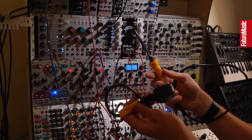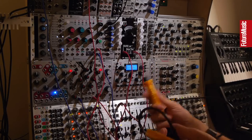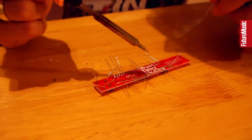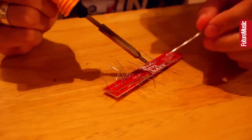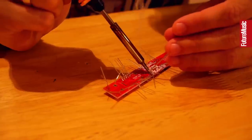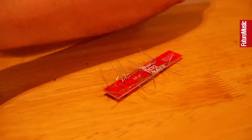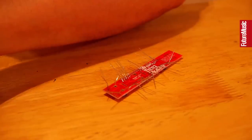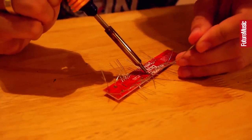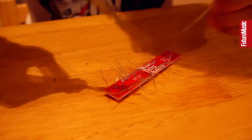It won't cost you an arm and a leg — just a simple electronic soldering iron. You can buy little kits that have the iron, a little cradle to slot it into, and the solder itself. Get one with a chisel tip. The other thing is to be nerdily fastidious about keeping your soldering iron clean. If your soldering iron gets oxidized — as in it sort of dries and becomes rusted — the heat will not conduct between the tip and the part, and it won't solder. So you dab a little blob of solder onto the end to tin the tip, then wipe it. What I actually do is leave a live blob on the tip and stick it very carefully into the joint. You're probably not supposed to do that, but my tips don't tend to oxidize.